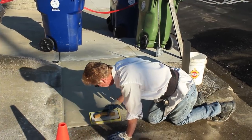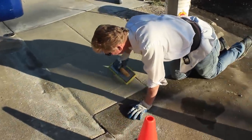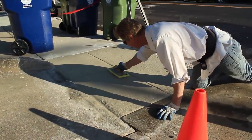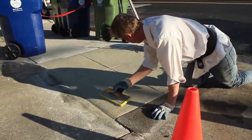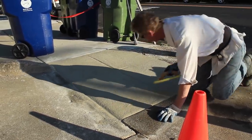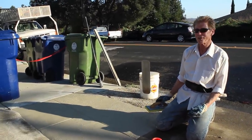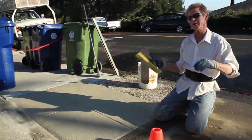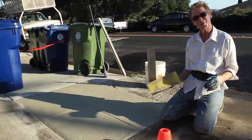I'm just showing it because I thought I'd kill two birds with one stone — meaning when I get home, I'll take a picture for all those people who keep emailing me about that notorious video. You can resurface concrete, guys — just don't do it this way, because poly bond is not really a user-friendly material. You mix it with sand, it takes a lot of years of experience. Go to Home Depot, buy some Quikrete or Sakrete — they have resurfacing materials for that.